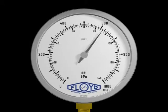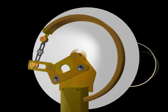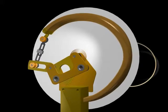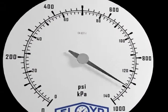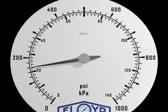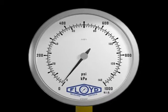Standard pressure gauges are manufactured so that they will withstand a 25% overpressure, but this would be for short periods of time only. In a higher overpressure situation, the Bourdon tube will enlarge and not return to normal shape, thus the gauge pointer will not return to zero. Once this has occurred, the gauge in most cases is not repairable and would need to be replaced.